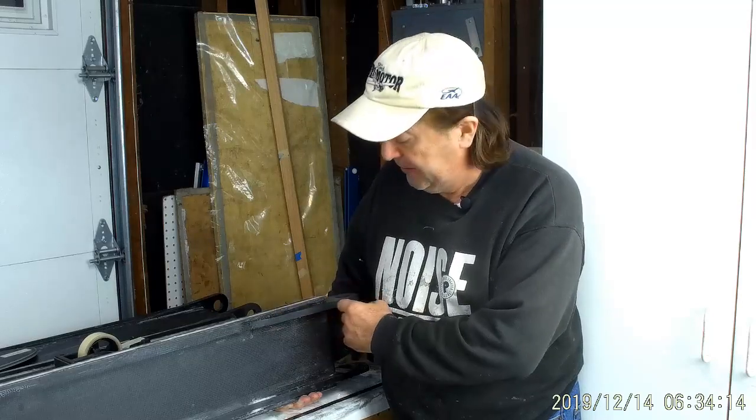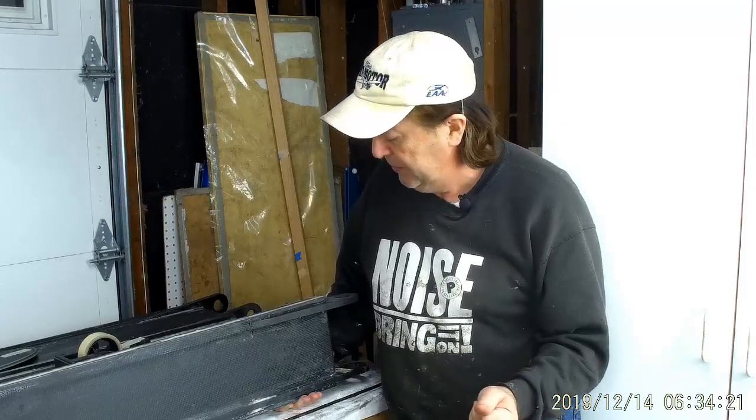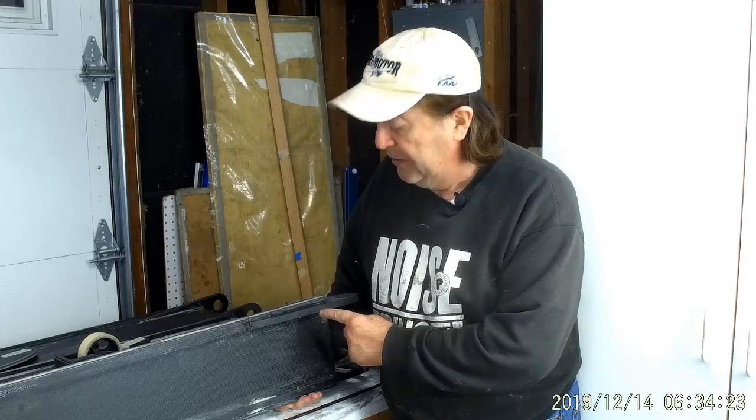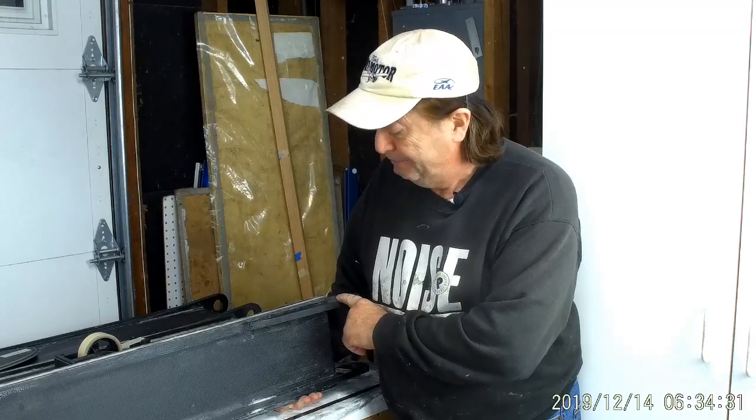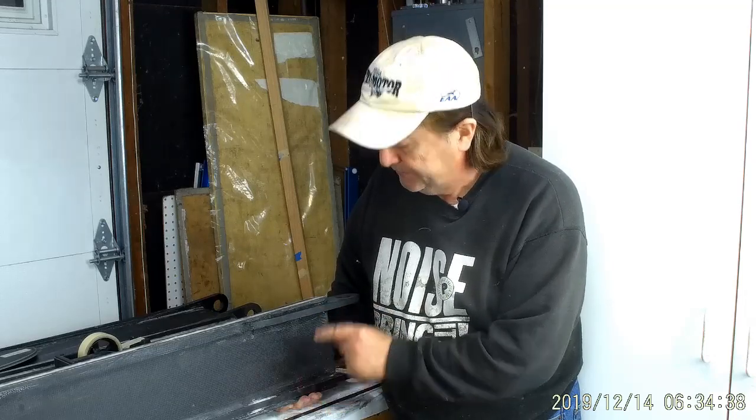So there's 7.5 square inches of area here, counting both sides, and the 7.5 square inches will carry 15,000 pounds of load. Well, what do you know? There's about 30,000 pounds of load that has to go through this fitting at 9 Gs. 30,000 pounds, that's a lot. So we have to somehow increase the bonding area to take all of those loads.